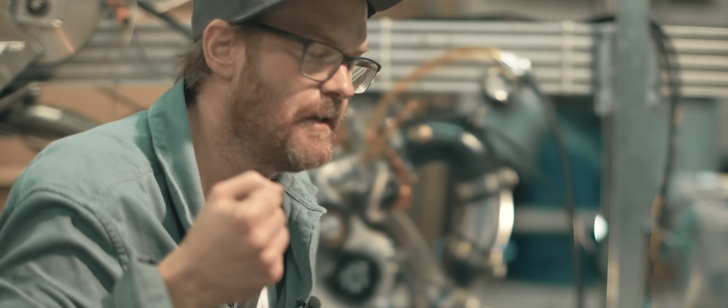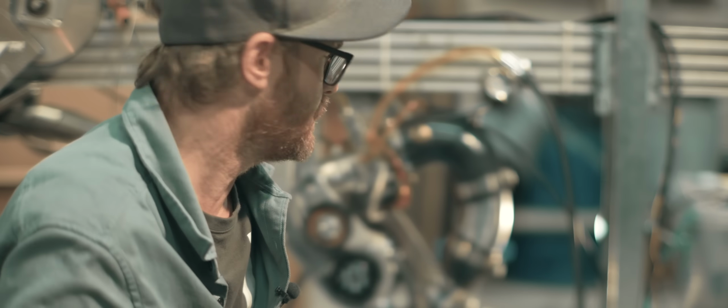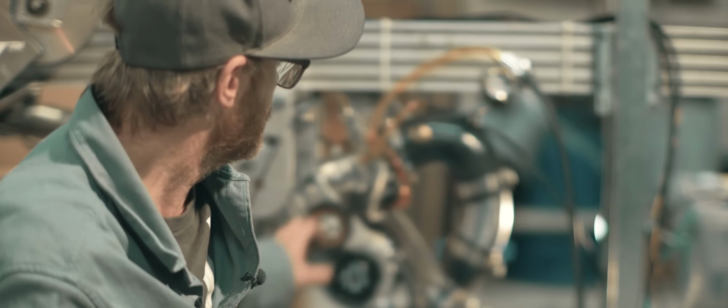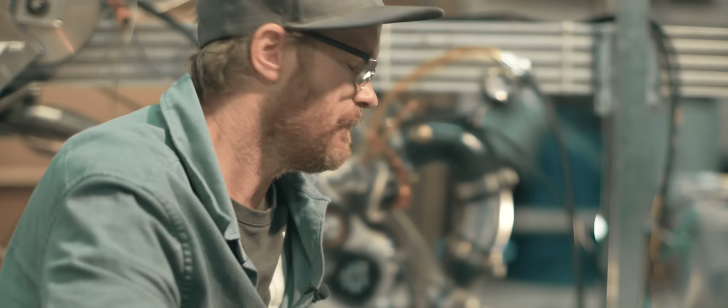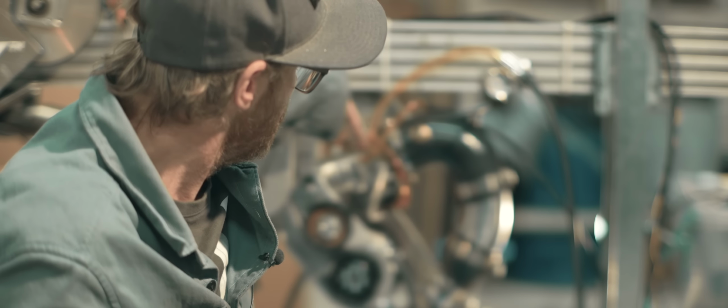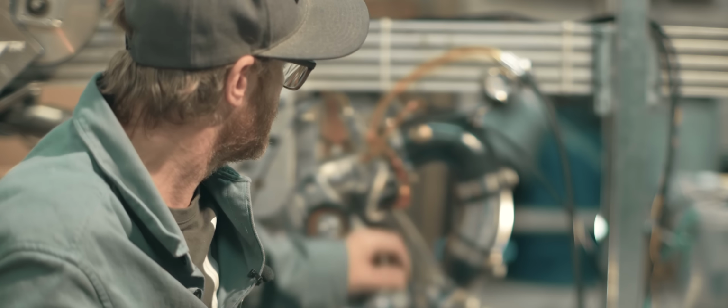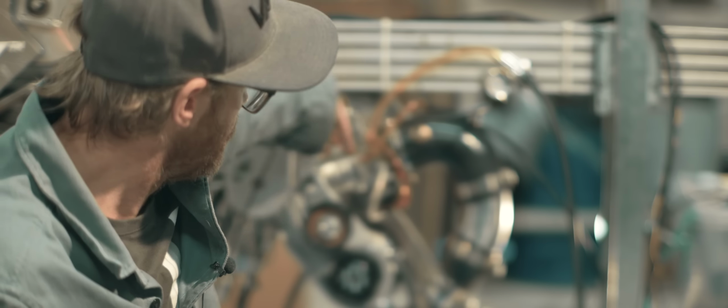I tried opening the sliding reed valve and I could see fuel immediately traveling up the tubes here, but there was insufficient airflow across them, and then it died every time. Now I've managed to jam the slide fully open. It's probably a needle that's jumped out of its tube and is bumping up against the casting here, because I've set it to the absolutely richest position possible. Seems to not be a great idea because it can jump out of the tube. We'll need a much richer metering rod or grind this one.